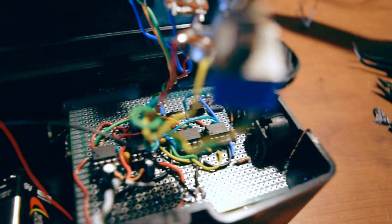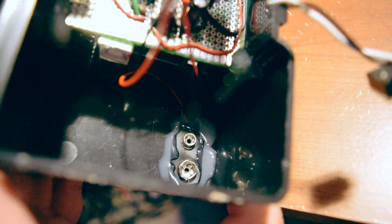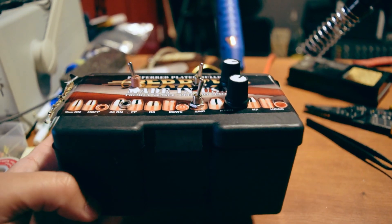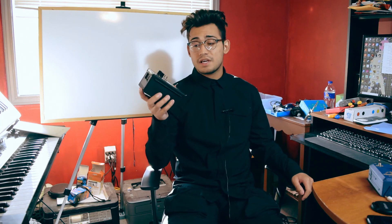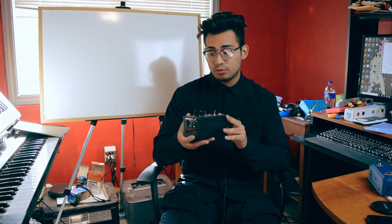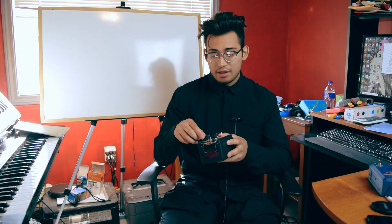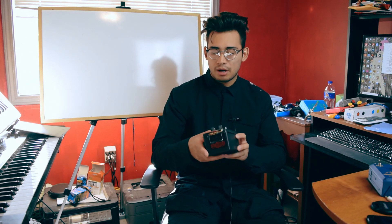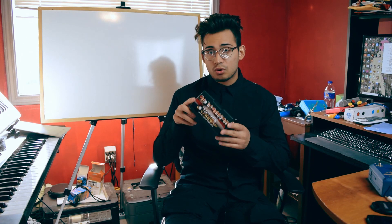The next steps were really mounting all the hardware. First I drilled out holes to mount the potentiometers, switches, and the audio jack. Once the holes were drilled, I mounted the hardware. I cut out some rectangular holes for the MIDI connectors, and then I hot glued the battery holder and circuit board in place inside the enclosure. As you can see, making an enclosure like this is really easy — all you need is the hardware, the mounting hardware, a drill press or hand drill, and a hot glue gun.